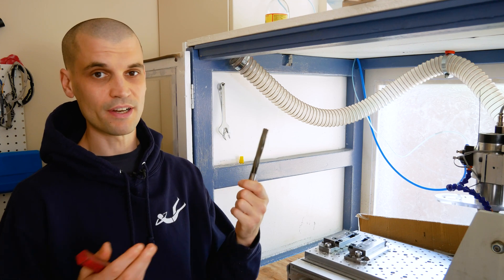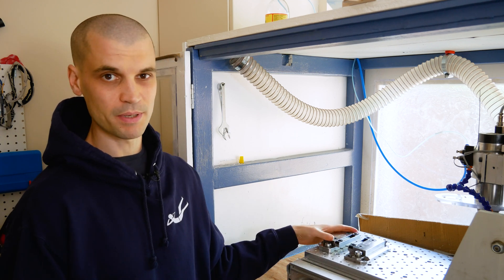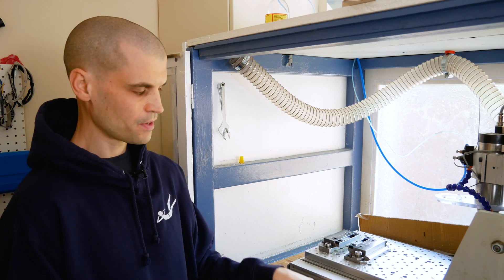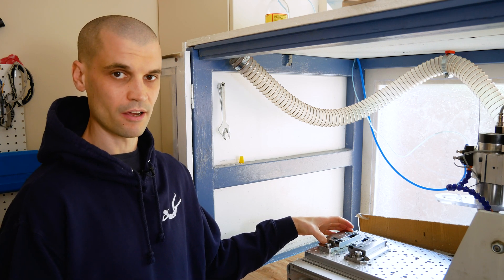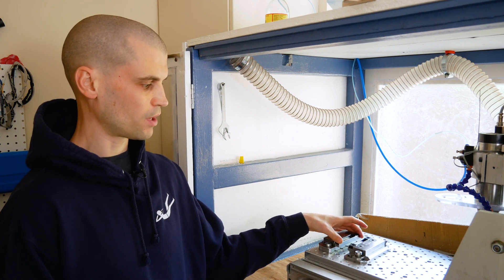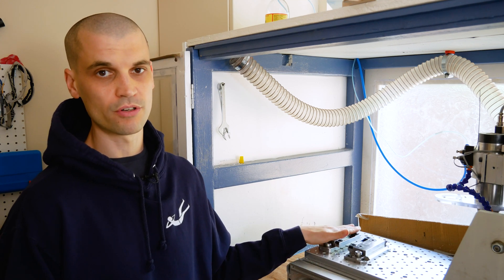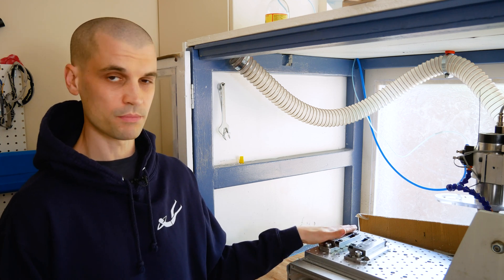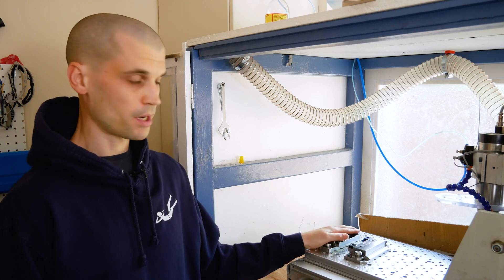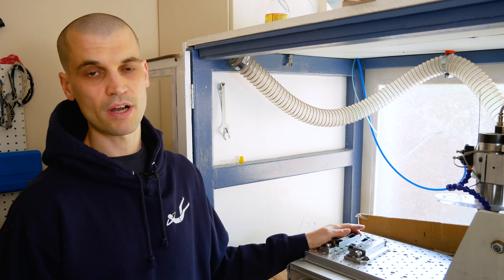I didn't do it for mine because I don't have a half-inch one — this is a 12mm one and I didn't really want to buy one just for these locator pins, as I'm probably never going to use a half-inch one again. It does have a tiny bit of play in the locator pins, but when it's pushed against the back of the holes, when I trammed it in, it's nice and level, so I don't really have too many complaints. I'd try and get hold of a hand reamer if you're going to be installing this on a hobby machine. I'll put a link below to the Saunders Machine Works website where you can buy this. If you've got any questions feel free to ask — remember to like and subscribe and I'll catch you later.